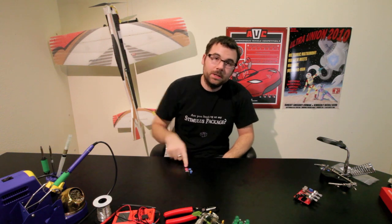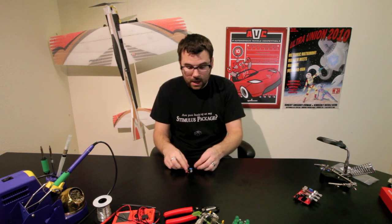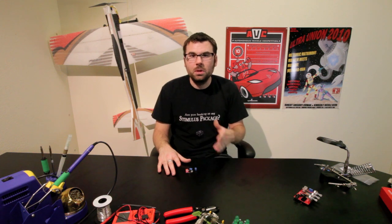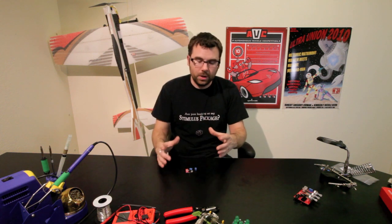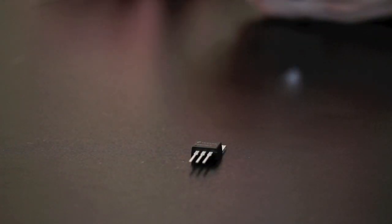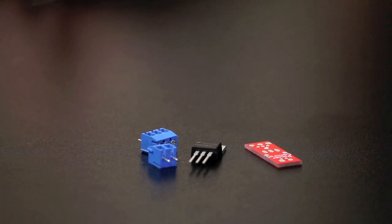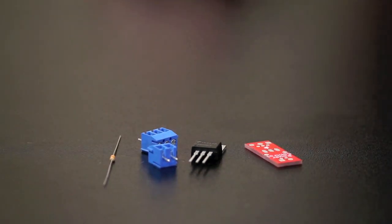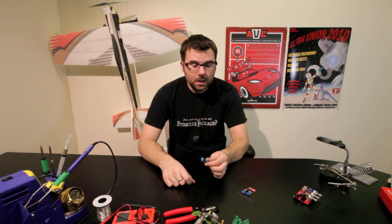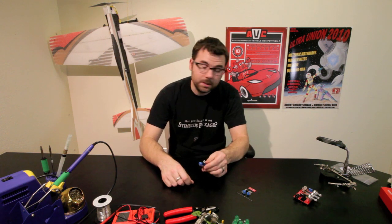This little pile of parts is the power control kit. You'll get a little baggie that will have these parts in it. If you've got a microcontroller and you need to control a little bit more current than what the microcontroller can handle, this will allow you to do that. It basically comes with a MOSFET, a couple of terminal jacks, a PCB, and a resistor. When you get them all soldered together, they turn into this little guy, so if you're needing to control a little bit more power than what your microcontroller can handle, this is definitely an easy way to go.